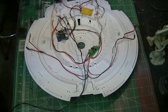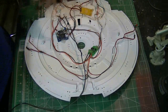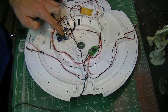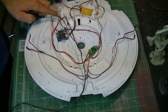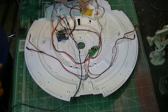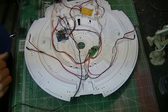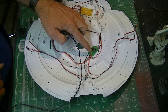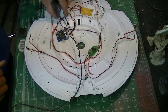Okay, we're really rocking and rolling now. You can see the boards are mounted. This is our little voltage regulator we just finished adjusting — nine volt power comes in on this line here, and four and a half volts comes out, running over to the Monsters in Motion board for the bussard lighting effect. Up here we have the Tenet Controls board, which needs nine volts, so I've got that tapped directly to my nine volt power where I split it off.